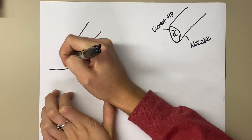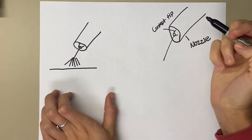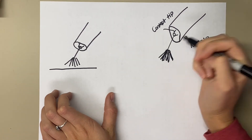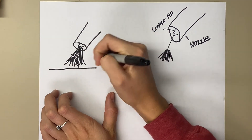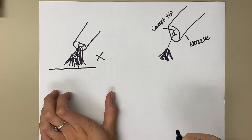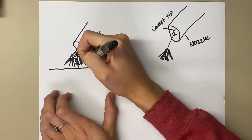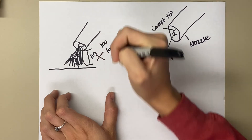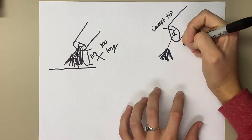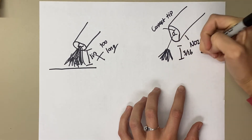You see the arc coming out of the wire. What you see is the tip, then wire, and at some point in the middle of the air it turns from wire into a spray cone. You want to see the spray cone — but all I was seeing was the spray cone, I wasn't seeing the wire coming out. The spray cone, no matter whether you see wire or not, should never be longer than about three-sixteenths to a quarter inch. If you have a spray cone that is three-quarters of an inch long, there's an issue.